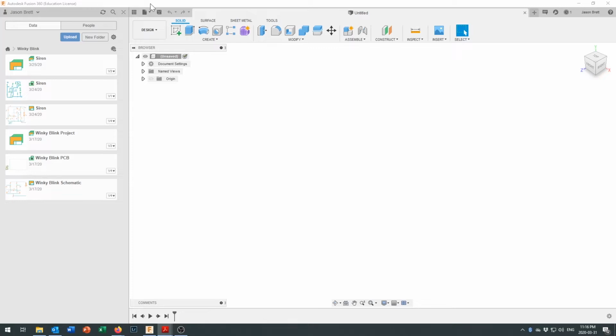as we go through and create our schematic right in here. Before we start creating that schematic though, I want to take a moment to talk to you about libraries, because I've run into a few library parts that I don't really like in the libraries that Fusion 360 has available for you. If you'll recall from our previous tutorial, one of the challenges is that some of the library manufacturers have been using the polarized capacitor symbol for their non-polarized capacitors. They just shouldn't have. There's no reason. It's easier to make the non-polarized symbol. So let's take a look at how we might make our own capacitor, and we'll put it in our own library, and then we'll carry on from there.